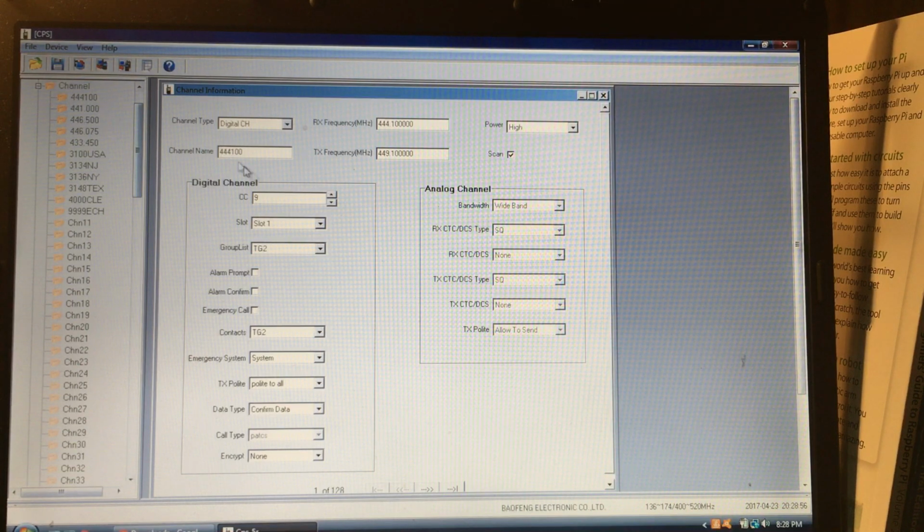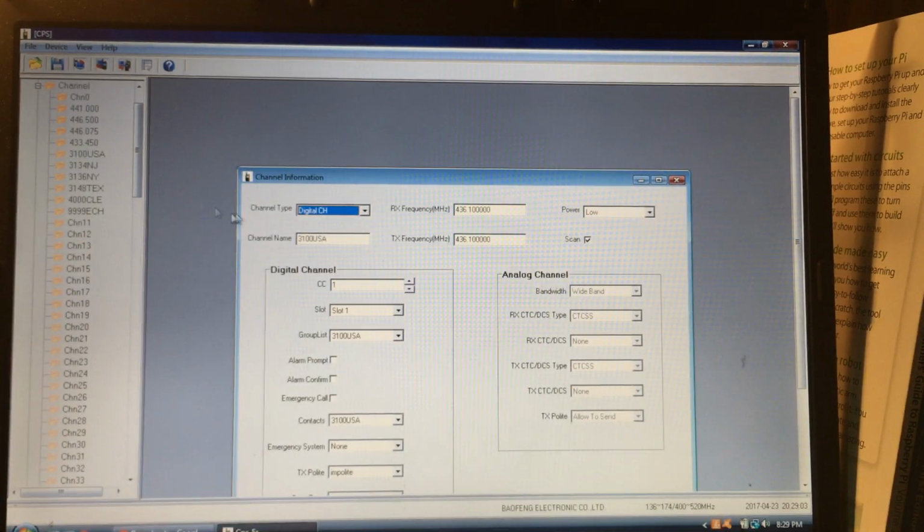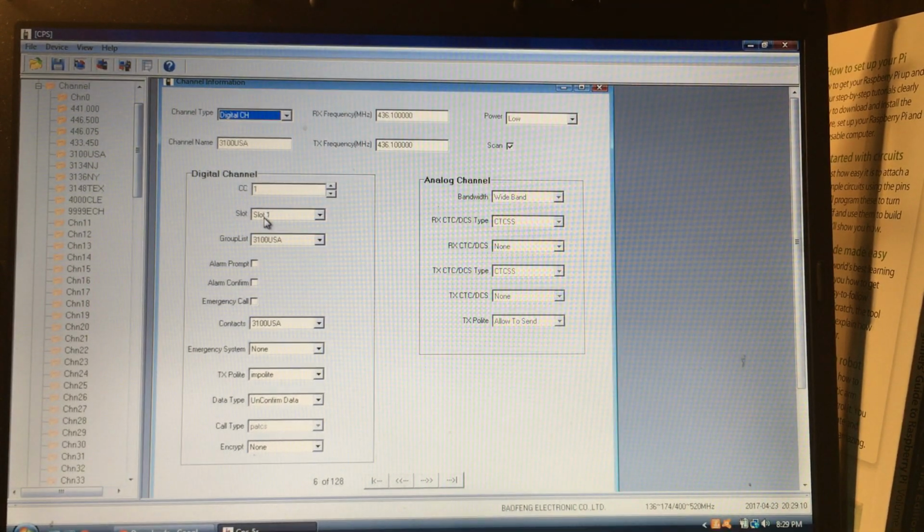I'll show you a channel itself. So let me shut this channel off. Channel 0. I'll go to Brandmeister over here, 3100. So I'm using color code 1, slot 1, group list 3100 USA. I have these off. And here's the contacts, 3100 USA. I leave that as none. Impolite, I leave the way it is. I leave that alone.